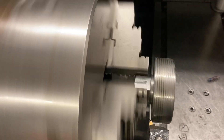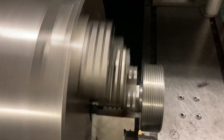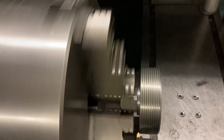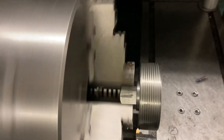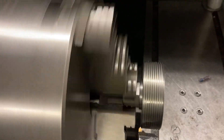A little smoky, but it looked good. I was running the test piece a little faster, but it's mild steel and I don't know what these are made out of, so I slowed it down a little bit. I ran the test piece at 340 and she was smoking. I brought this one down to 185. If this one cuts good, the next one I do I'll speed it up. But for the purposes of what we're doing here, we're going to cut this one at 185.